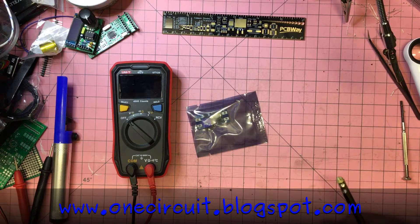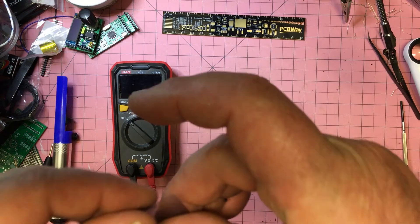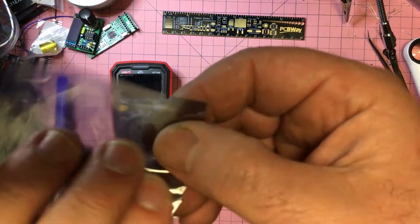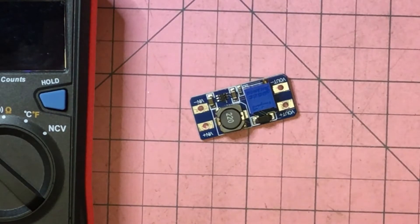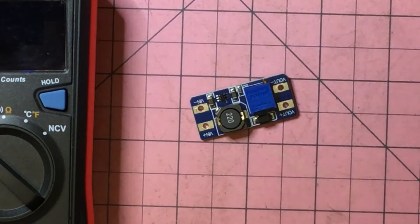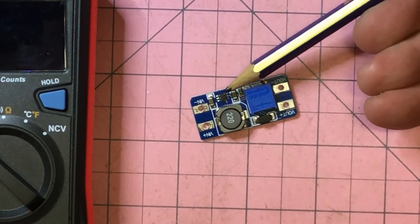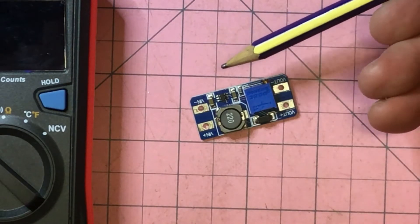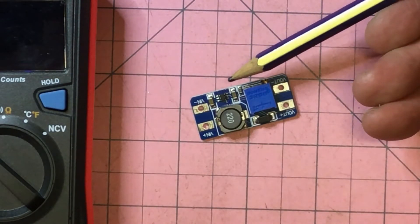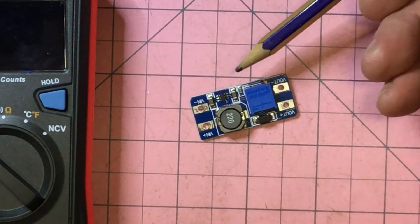This video is mostly about the MT3608. If you've seen these DC-to-DC boost converters before, you'll know a little bit about what they're capable of. They come like this standard converter that you get for around 80 cents plus freight. They're a pretty impressive little beast, based on this six-pin MT3608. You can put an input of around two to twenty volts and the datasheet states an output of around 28 volts.